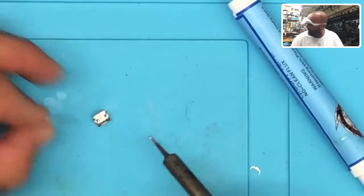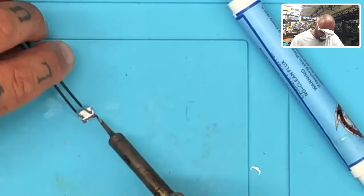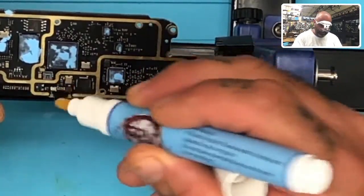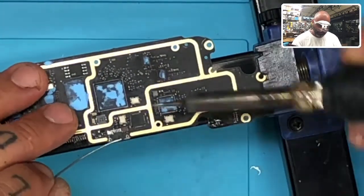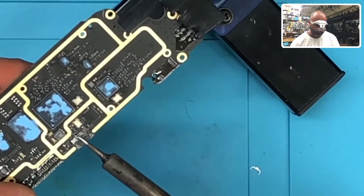I'm going to make sure I got this on camera. The whole one side — and you're not trying to put a ton here. You're basically tinning these really, really tiny. Just like that. Because all you're going to do is touch them for a second to the board. Now that they're tinned, they're going to bind real quickly. Now what we have to do is let's tin the board. Let's bring the board back and get our flux paste ready. We already kind of tinned the board, but we're going to do it again anyway. We've got five pads — just get in position to touch the pads. Don't bridge them. That's perfect. I think we're good on the solder.